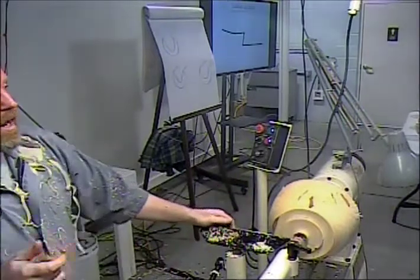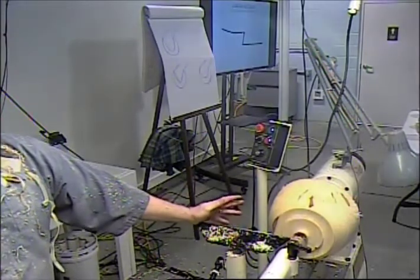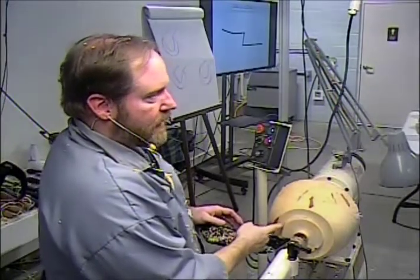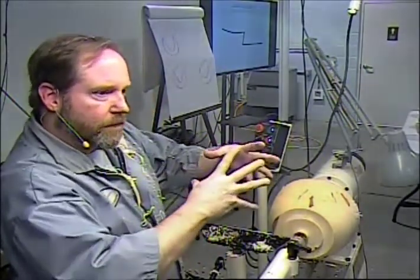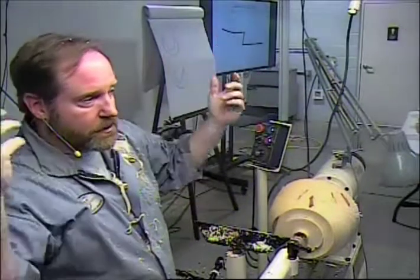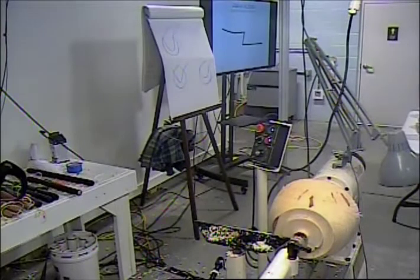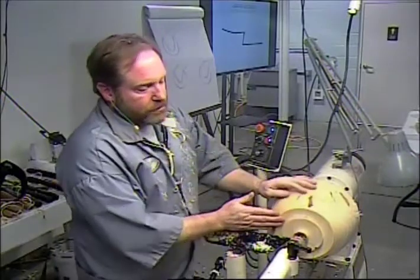Now, by a show of hands, who's launched a bowl out of their lathe? I just did it like 3 weeks ago. This is probably why, because you didn't have that completely flat against your chuck jaws. So as you're turning the inside, that bowl is just sitting there flexing and flexing until eventually it just comes right out. So if this point doesn't contact your chuck jaws, it's going to move on you. All right? Now, with what we've just done, I've actually created a problem, though.